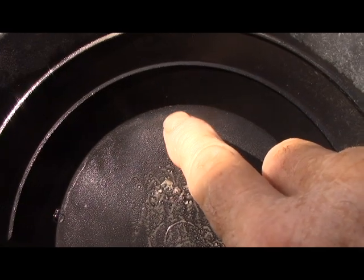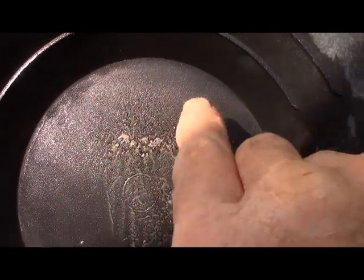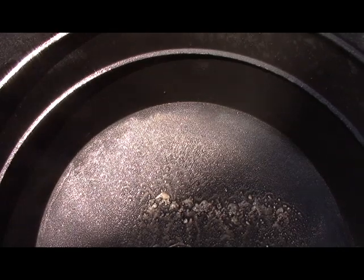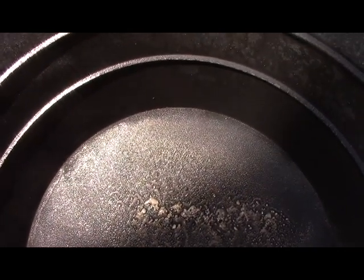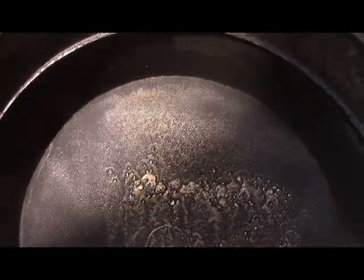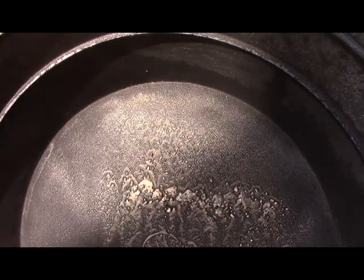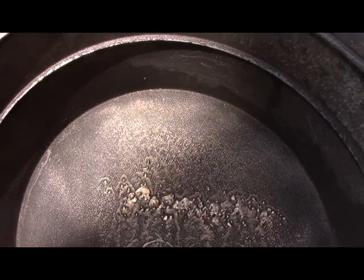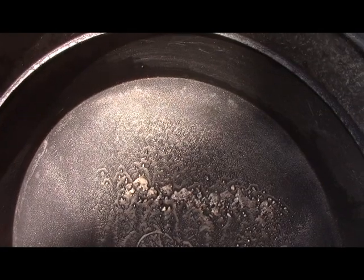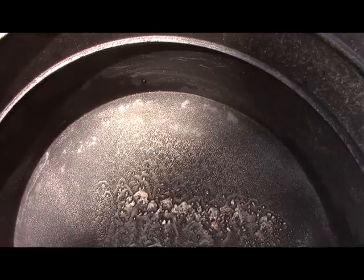Ooh. You can see this gold here has reduced a fair amount. You don't see as much up here. That floated out. Now that stuff there is 500 mesh minus. There's a few chunks up there that are more in the neighborhood of 300 mesh. But most of that, see if I can get the lighting just right, most of that's 500 to 1,000 mesh. So we'll see what this assays. That would leach really fast if we were effectively able to capture the gold in that bucket bottom.